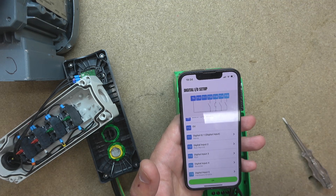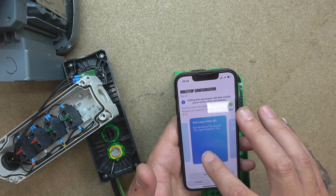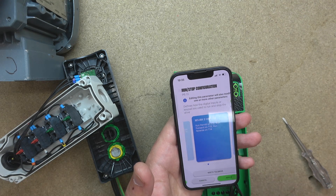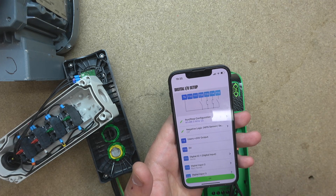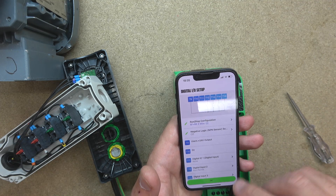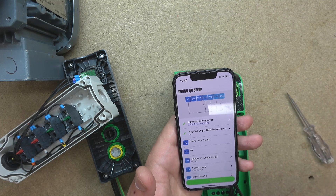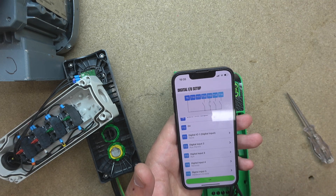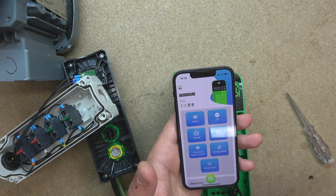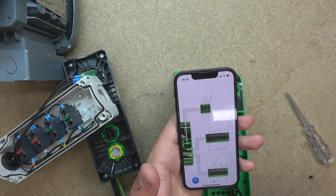This is how I have chosen to set it up: run/stop configuration — I've chosen run plus reverse three-wire control, though there are other options. As you can see, T13 is shown like a broken switch — that's a pulse, telling you it's going to be a pulsed signal. Then we have run permit, which should be normally closed. I've also added hardware enable on T15 for my e-stop. There's another three-wire option for jog and another three-wire where reverse can also be pulsed if you wish to use a button. I'm going to keep my switch. The wiring diagram shows: run permit, run, reverse, and hardware enable.